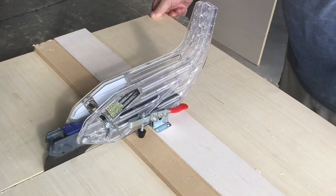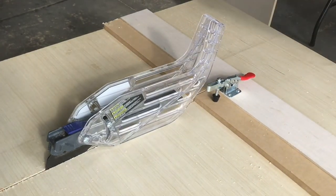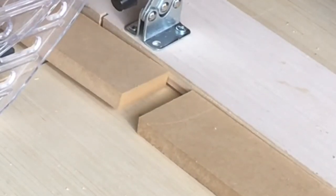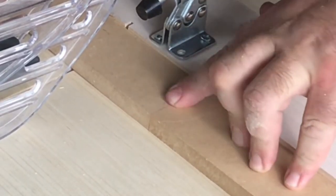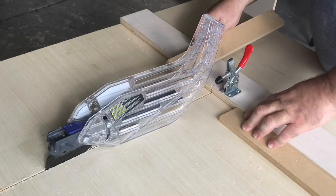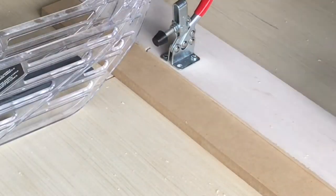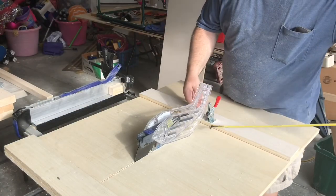You'll notice how my hands can be completely away from the blade yet the piece I'm cutting is secure. I can raise the clamp, examine the piece, even put it together and see that it matches perfectly square each time — flipping one piece over, it's still square. In addition to setting up stop blocks on the table saw sled itself, I can set up stop blocks against the fence, allowing me to adjust them to any length I want and have repeated cuts.